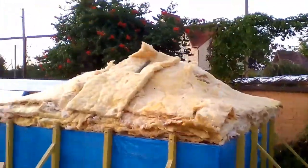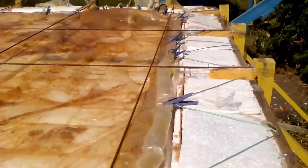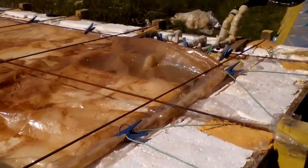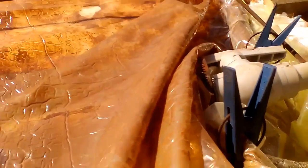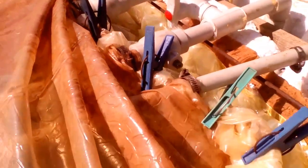Thermal insulation of the roof is a single layer of mineral wool. The liner can be very thin — about 100 microns — and the liners can be connected through twisting by a roller. Pipes come into the storage through the junction of the liners, though these sealing methods can be replaced by more reliable ones. The maximum operating temperature of version 3 is 50 to 60 degrees Celsius.